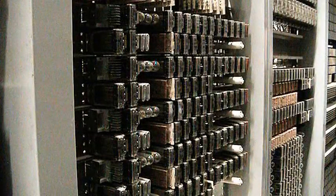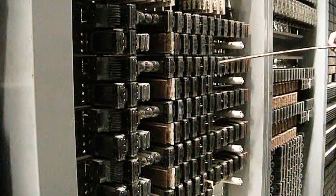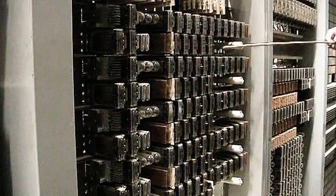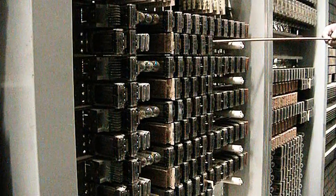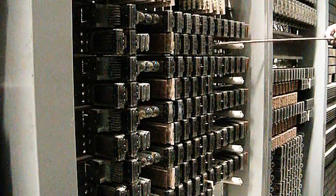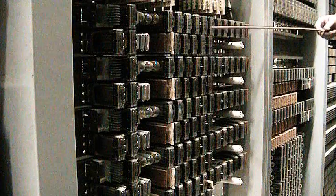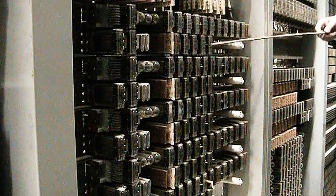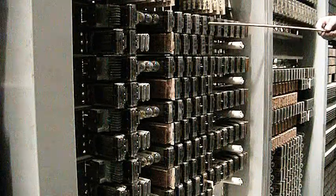I've included on this a shot of the operator trunks. One thing that's kind of interesting is every trunk in the system is a single mounting plate of relays except for the operator. The operator of course had the ability to collect and return coins in pay phones, as well as ring the phone back, and there were other functions that the operator could do, and so they ended up using 2 relay plates. So we have in this office several of these operator trunks, but these take up more real estate than the singles, and of course these were probably the least revenue producing of any particular item in the office.